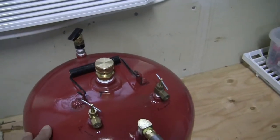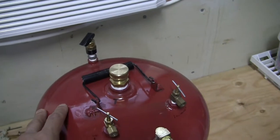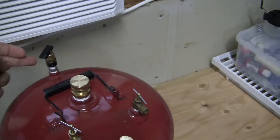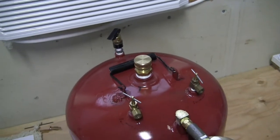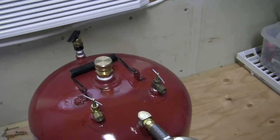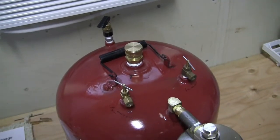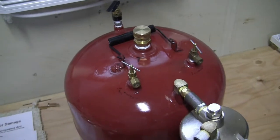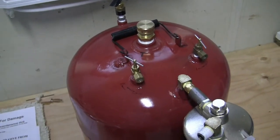And if you're going from a higher pressure to a lower pressure, what they recommend is that you pop the valve, release all the air, and then ramp it back on up to the pressure that you want. They said if you don't do that, there's a possibility that you could force abrasive back into the regulator, causing it not to work.